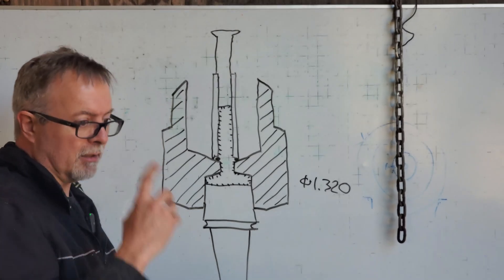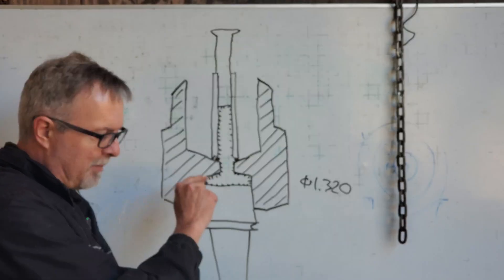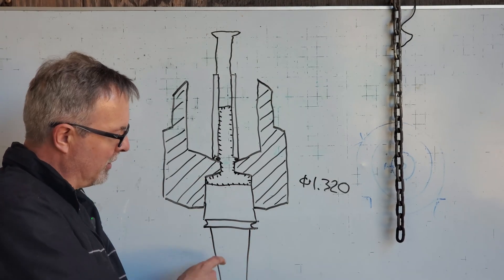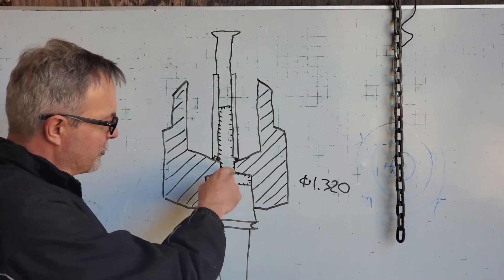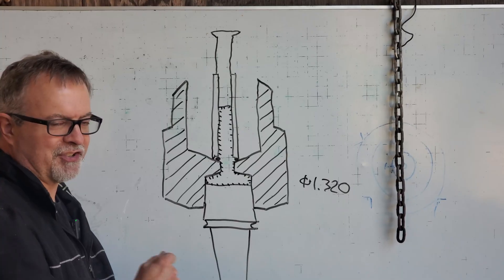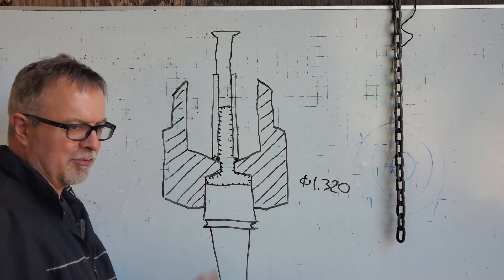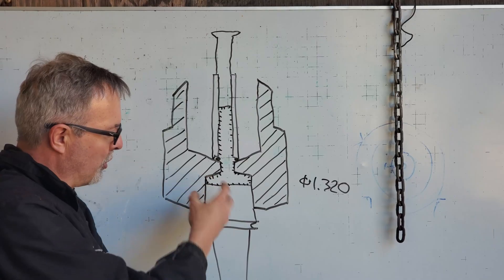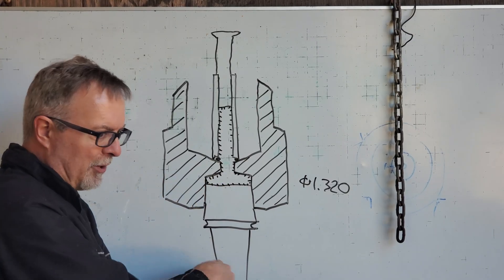I used this trick before on the quill stop on my Monarch lathe. That was a blind cavity, but it had a stud coming up through the center. I was able to get the stud out, packed that inside cavity full of grease, found a mandrel that just fit inside that quill stop, drove it down with a hammer, and that pushed the quill stop up out of the bore. You've got to make sure all the air bubbles are out — when you're hitting an incompressible fluid retained by something that doesn't flex, it felt like hitting steel on steel. But it slowly drove that quill stop out without damaging anything. Same principle applied here — we'll put this thing in a suitable setup to support it, and I hope to see that Jacobs taper arbor drop out with one hit. Let's give it a try.